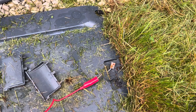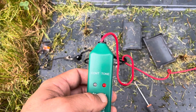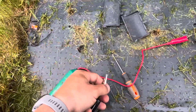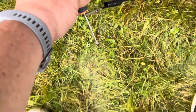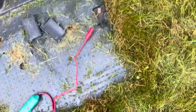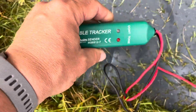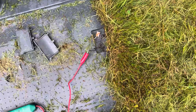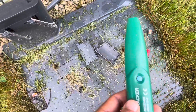Now that we've confirmed there's no contact between this end and that end — meaning there's a cut or the cable is broken somewhere around the lawn — we have to find the actual place. Disconnect the black cable, put it on a screwdriver or something similar, ground it by sticking it into the lawn. The red cable is still connected, then you switch this thing to tone, and it will start sending a signal through the cable which will be tracked with the other part of the device.